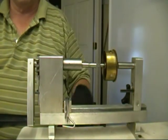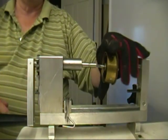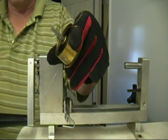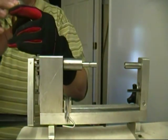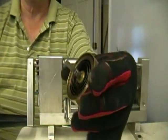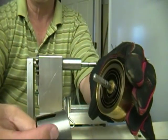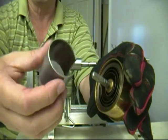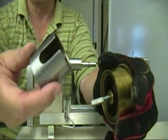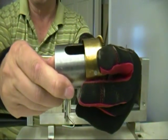What we're going to do is — I almost forgot — once we wind it up inside that barrel, we're going to have to capture that spring inside there. We've got the barrel with the spring in it, and now we have the adapter, the actual spring clamp itself. You want to make sure that the little horseshoe part of it goes into the barrel.